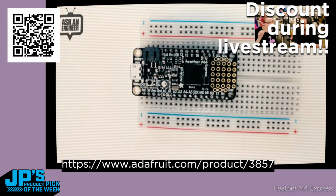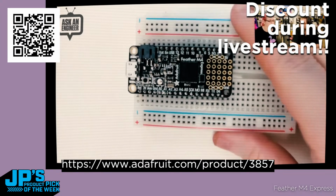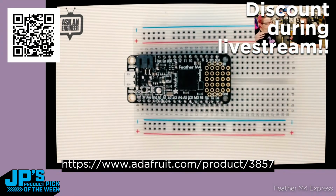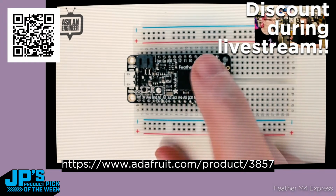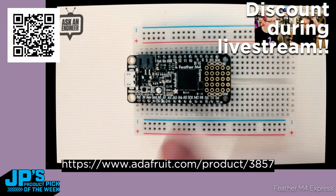The reason this Feather took a little bit longer than expected is we originally designed this with the G19 and then realized that it doesn't have I2S. The I2S was the last thing we checked, and we realized for some reason that size chip didn't have I2S enabled. Why? I don't know. If someone at Microchip could tell us, it would be great. So we quickly redesigned it to use the 64-pin QFN J19. Now you have I2S. We know I2S works.